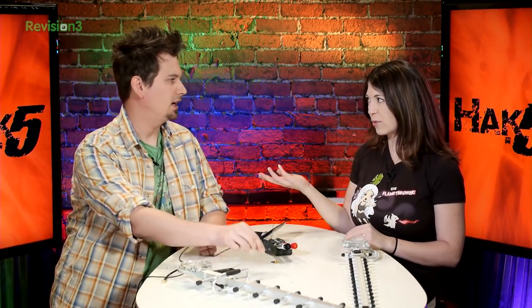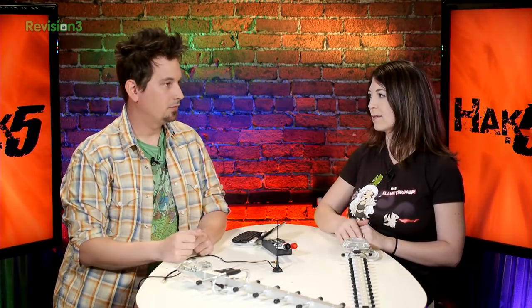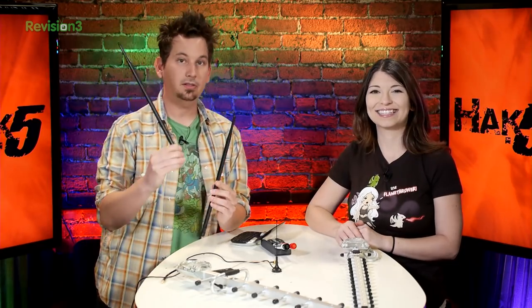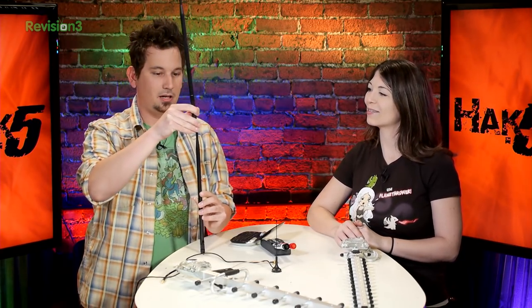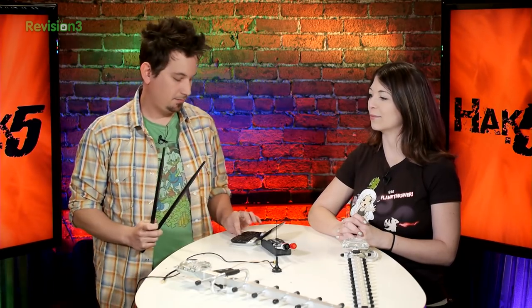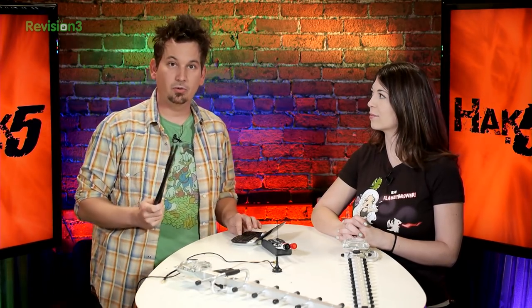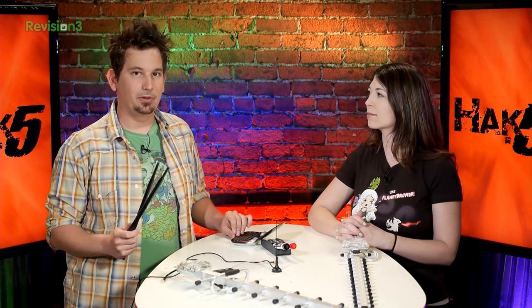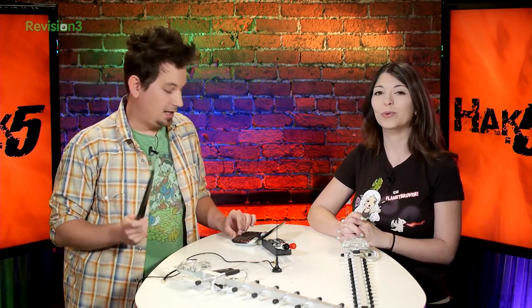Dipoles. The one that comes with the Wi-Fi Pineapple, that's a dipole, right? Clover leaves. Here's actually a few. There we go. And so these are fun because they've got a really good pattern that kind of goes out and around most places. And we're actually going to be using this kind of type in an array today when we build our ADS-B antenna. And that is of the type of coax collinear antenna.